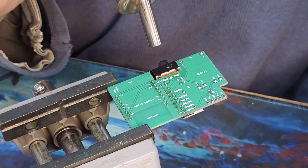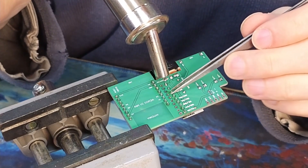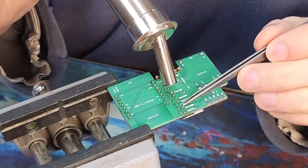As a demonstration of tools that make this easier, here I'm using a hot air station to cleanly remove an IMU. You should heat the back of the carrier PCB for this. IMUs don't like the high heat of a hot air station.